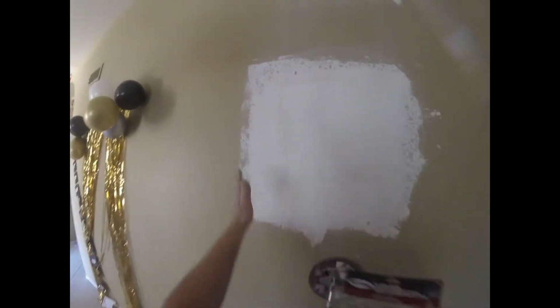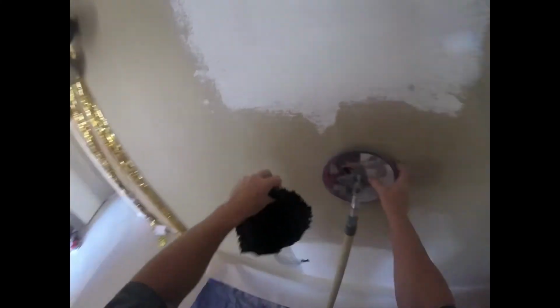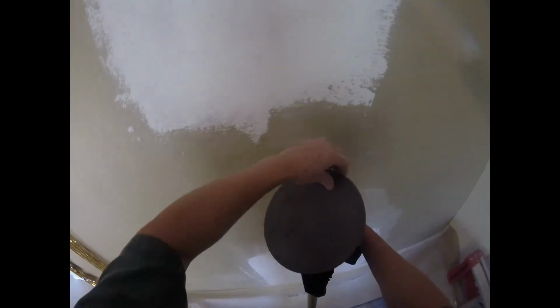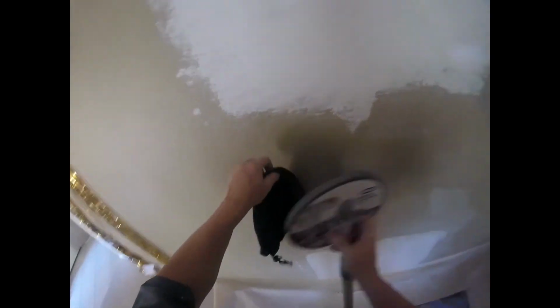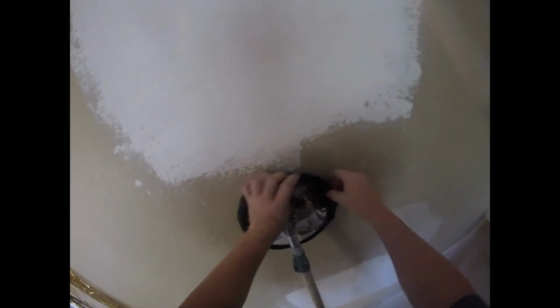Usually when you sand high ceilings and high areas like that, your sanding square head will flip and flop on you. You have control over this. This item has an accessory. It's a bonnet, a 9-inch bonnet that goes over. It's called a de-duster. You just take the sanding paper off, put the bonnet right over the 9-inch radial sander, and then you tighten the drawstring and it's ready to go.